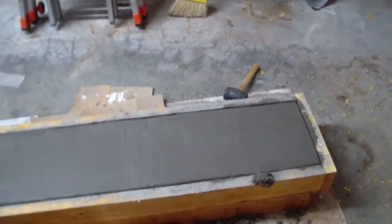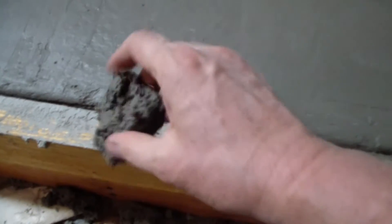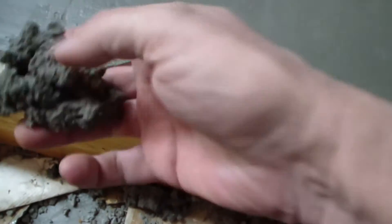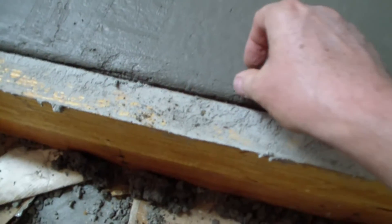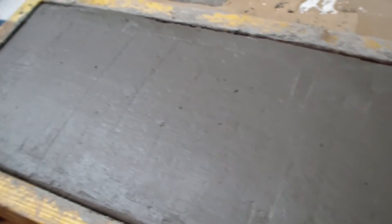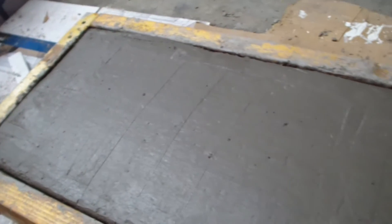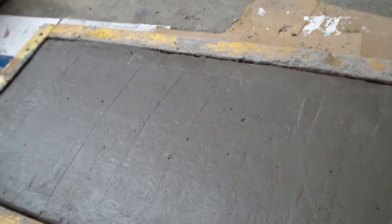It's been a few hours. The surface still appears moist but it's hard — here's a clump and it's a nice hard clump. The thing is, I say harden, not dry, because concrete doesn't actually dry. The hardening is a chemical reaction where water mixes with the concrete and causes it to solidify. Water is a key ingredient — concrete can actually harden underwater and it's not a matter of drying out at all.